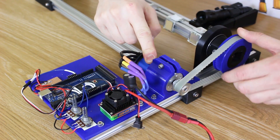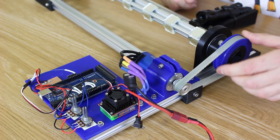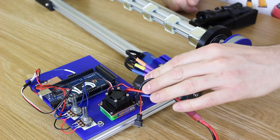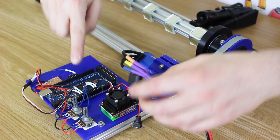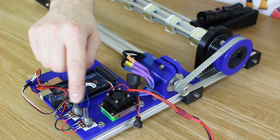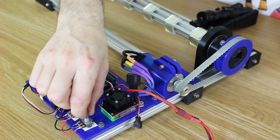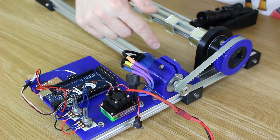I've now got this brushless motor — it doesn't have to be a brushless motor, this is a brushless inrunner that goes pretty quick. We could use a DC motor; I just happen to have one lying around, along with a radio-controlled car speed controller driven by a servo PWM signal. I'm driving that off the Arduino Mega that's going to control everything. I've got two pots: one for sensitivity of the whole system, and one for the speed control of the motor.